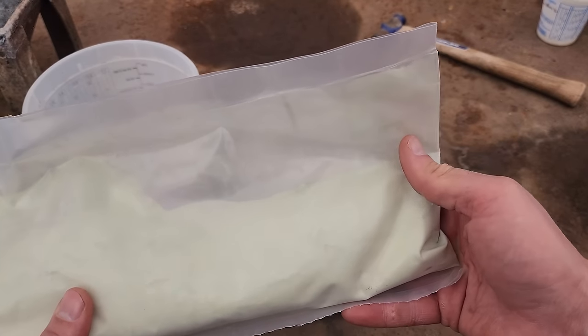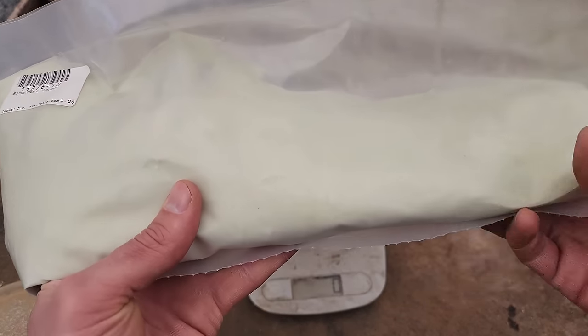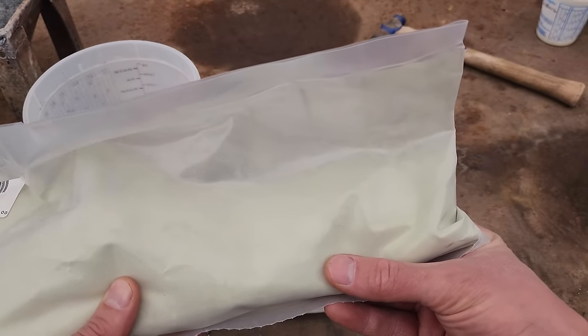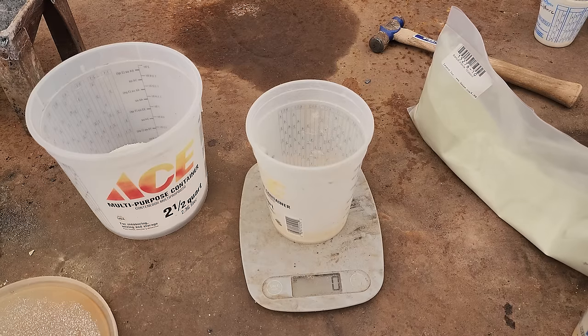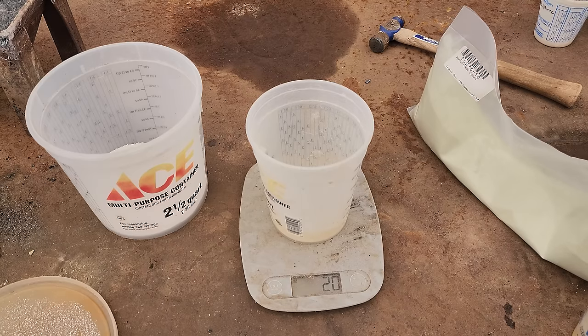This is bismuth oxide. And in the past for my collector metal, I've used bismuth metal. But with the oxide, you get a couple advantages. The first is it has oxygen attached to it. And what the oxygen does is when it comes in contact with a sulfide molecule, it reduces the bismuth to metal and it oxidizes the sulfide.